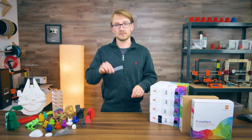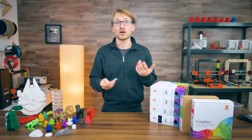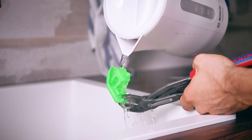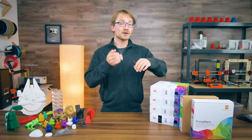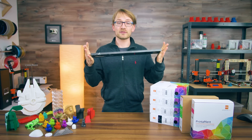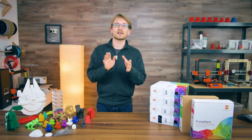But here's the catch. PTFE, commonly used in hotends at up to 250 degrees as a liner to keep filament from sticking to the wall of the hotend, has a TG of only 115 degrees. Polypropylene, a perfectly dishwasher-safe plastic often used for food containers, has a TG of 0 degrees Celsius. PLA, on the other hand, definitely doesn't survive a dishwasher cycle, even though it has a higher TG at 50 degrees. And here's the kicker — PE, polyethylene, a super common plastic, has a TG of negative 70 to negative 100 degrees Celsius. POM, an engineering material used specifically for its stiffness, is always used way above its TG of also negative 70 degrees (that's negative 94 degrees Fahrenheit), which is quite cold. Most flexibles have a super low TG somewhere in that range as well.